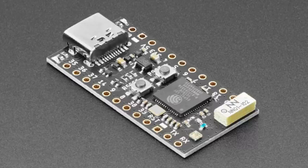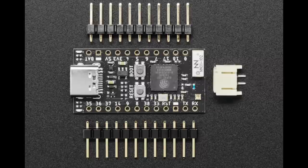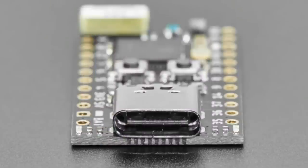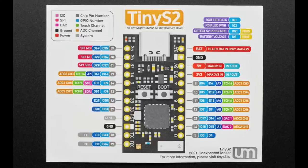We also have the ESP32 S2 — sorry, they look nearly identical. The ESP32 S2 runs CircuitPython. It's the newer version of the ESP32 processor — it's single-core, not dual-core, despite the '2' in the name. However, it does have native USB, which is why there's no CP2104 like on the previous one. It has a native USB bootloader, so you can use it with Arduino — they recently updated board support package 2.0.0 with much better ESP32 S2 support — and CircuitPython has great support as well. Check out Unexpected Maker's site for tutorials and more.